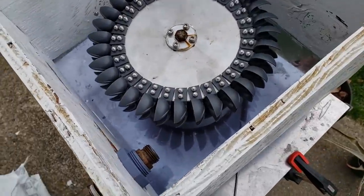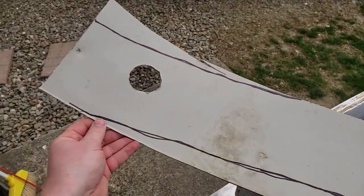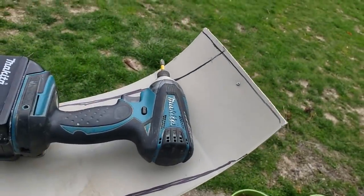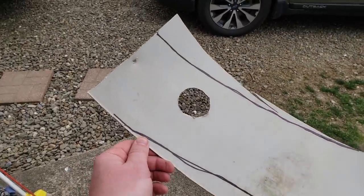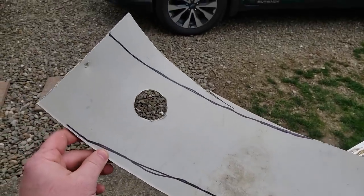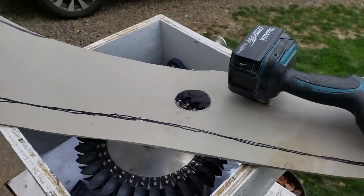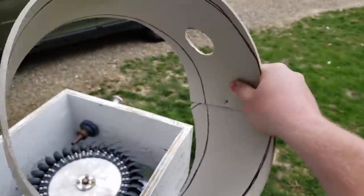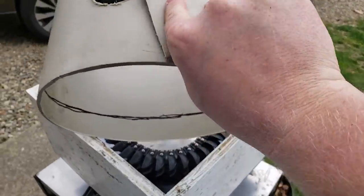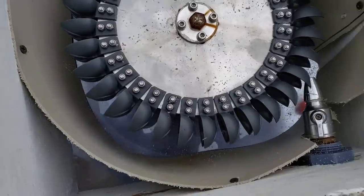Got the liner out - I need to modify this to be cone-shaped. Anyone who has experienced some geometry or done sheet metal work would know that a cone flattened out turns into an arc shape. I made a cone shape and traced the projected line of the narrowest portion. To draw a cone, you make a cone shape, take a projected line, then on the opposite side do another projected line from the narrow spot, and that gets you a cone. Let's get this cut out - and there we go, a very crude cone.